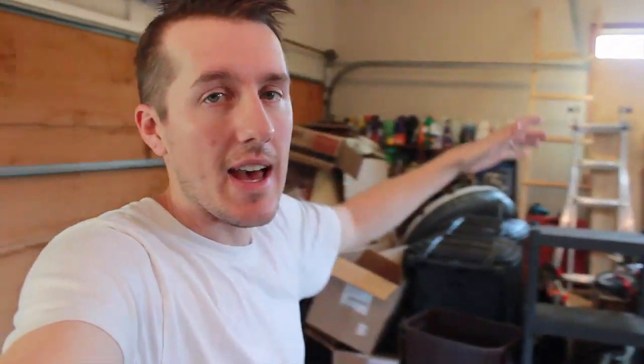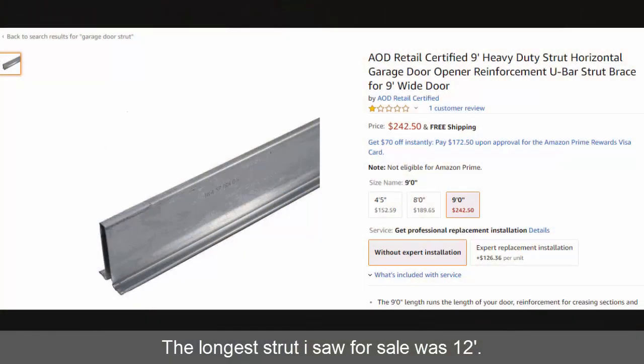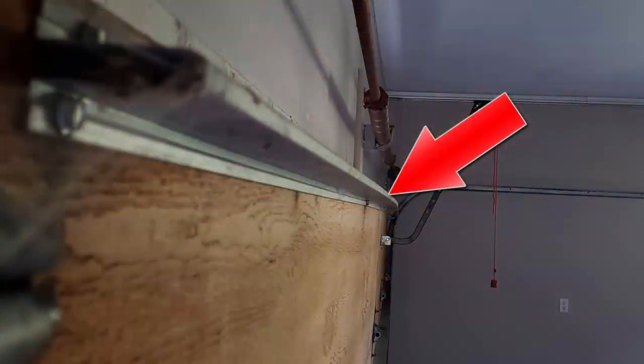When the door is up, the weight of it causes it to sag. Typically, the way you would fix that is to install a metal strut like this. There are actually two on the door, one here and one here, but those are completely bent as well. They've probably been up there for a while — they were probably good when installed, but over time they've become bent too.